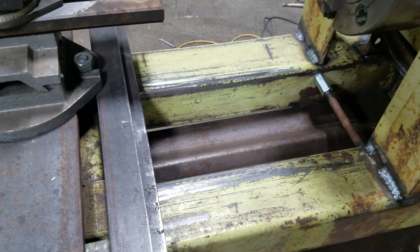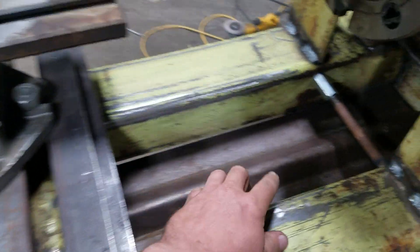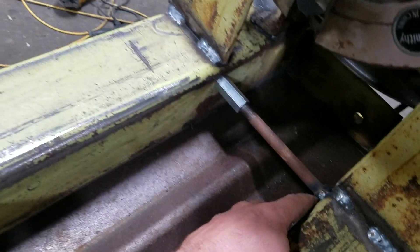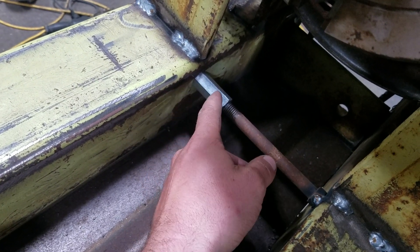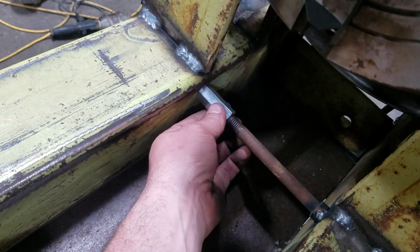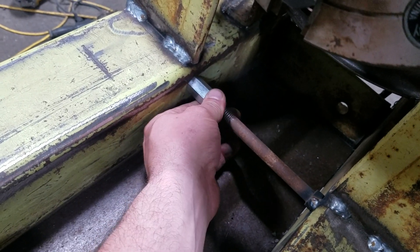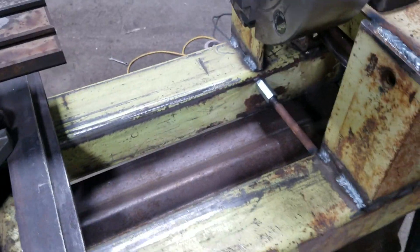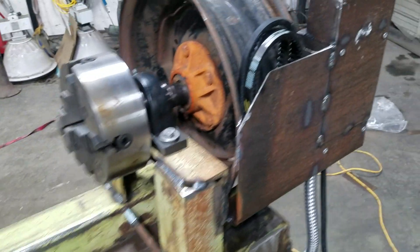I found my ways weren't exactly precise in their spacing, so the table was jamming up a little bit. I tacked a bolt right here, used a long threaded coupler, and spun that out. There's not a lot of tension, just a tiny bit — gives me the perfect fit for this table. Seems to work pretty good.